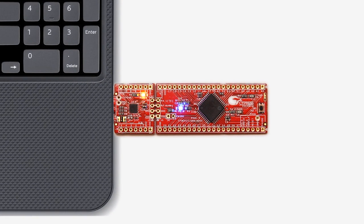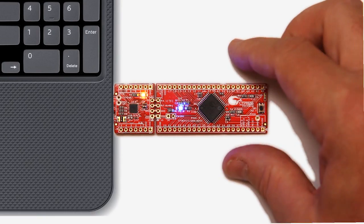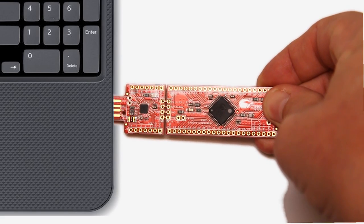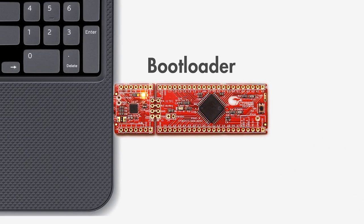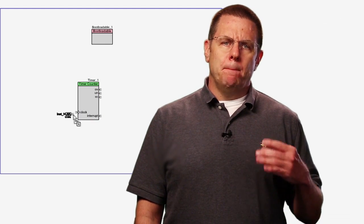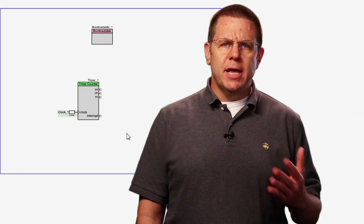Normally, when you plug the board into a USB port, it starts in the bootloader application and then quickly jumps into the bootloadable application. But if you want to reprogram the board, you hold the SW1 button down as you insert it into the USB port. That forces the board to stay in the bootloader application. This works just fine, but if you are doing rapid iterations in your project, the procedure gets a little time consuming and is quite frankly a little bit annoying. So I figured out a way to quickly reset the board and jump back into the bootloader from any application.